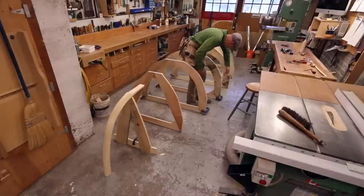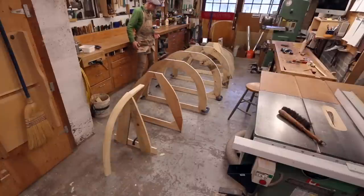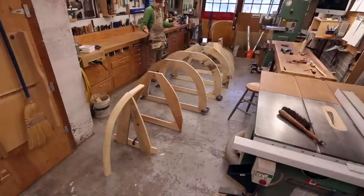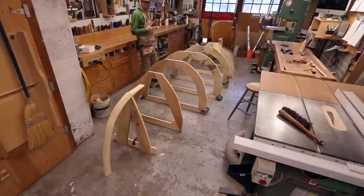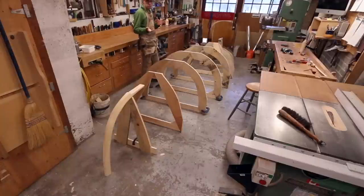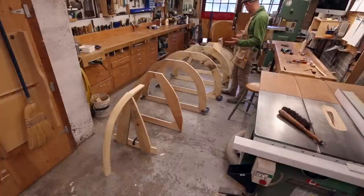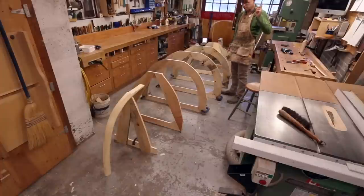Our shear line all stops right around here, so there's a whole bunch of this that is not going to be in the boat — right now it looks very deep and tubby as a result, but it's going to look a lot more svelte once it's down to the shear line. So far I'm really happy with our progress. Everything's ready to go together — got to build a strong back, and I need to scarf my planking. I'm having really strong debates in my head about whether to pre-scarf my planking or scarf it on the boat itself.